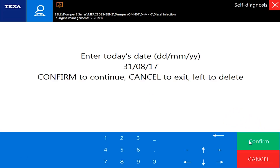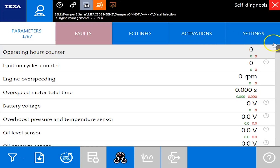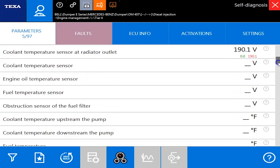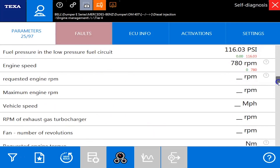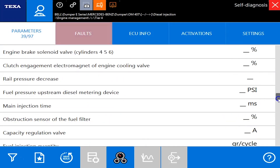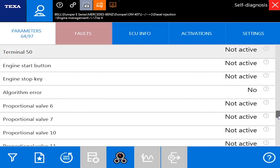These connect fairly quickly and we do have pretty good coverage of these Bell trucks. You'll have to enter the date, which will actually be in European standard. Now that we're connected, we'll go into the parameters. We've got 197 parameters here — this will be your oil level sensors, over-boost temperatures, fuel temperatures, rail pressure readings, some oil pressure, fuel pressure. Scroll down through all of these and they populate as you scroll down. It takes just a second to load, and some proportioning valves.